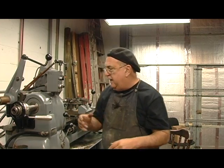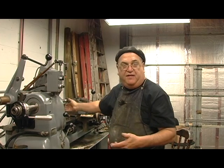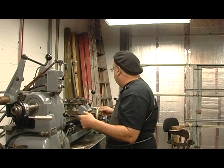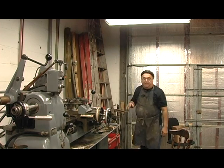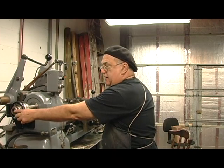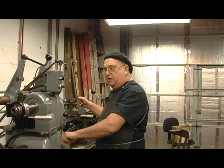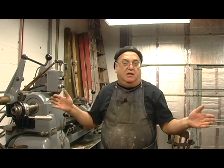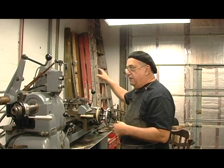It was a matter of getting the tooling together. The Burgmaster had to be done. I had to get rid of the CNC lathe and bring this one in, clean it, and paint it. It wasn't really hard to hook up — we have the three-phase already here, I have a 220 line there, and the air was all here, so it was pretty much a natural. Now, back here in the back, this tube way back here and these stands are a bar feeder I got additionally from another guy. It goes on the end of the lathe, works off air — you open the collet, hit the button, it comes out against the stop, you close the collet. That's an automatic bar feeder. You can put a six-foot bar in, but you're making small pieces, so it works out just right.